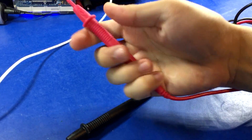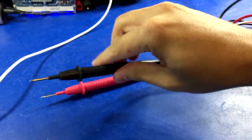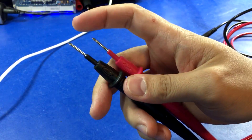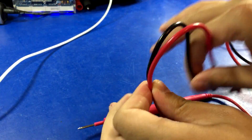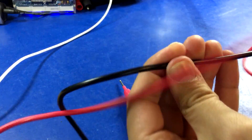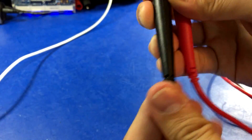These are the probes for the UNI-T UT61E. It's kind of a hard material — I wish it were more soft touch — but at least they're big so I feel like I can get a good hold on them. I like them despite not being rubber or soft touch just because of their large size. They're pretty sharp, possibly the sharpest of all, so sharpness: excellent. The cable is actually stiffer than the Fluke one, so these might now be the worst as far as flexibility, and I don't see any branding or labels anywhere. Not super huge strain relief but it has strain relief. Kind of average overall.